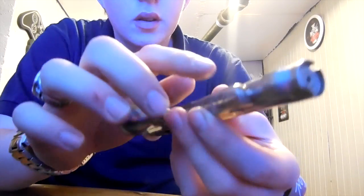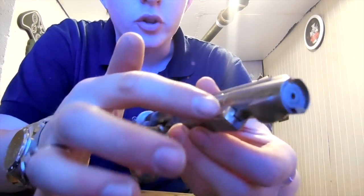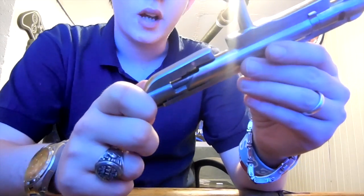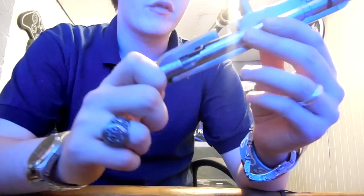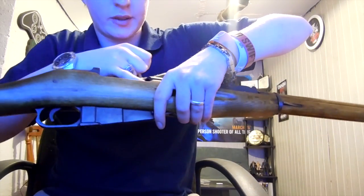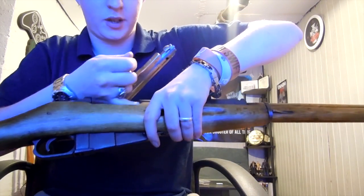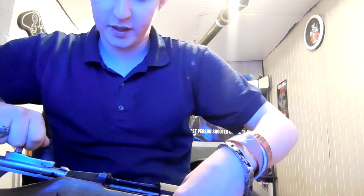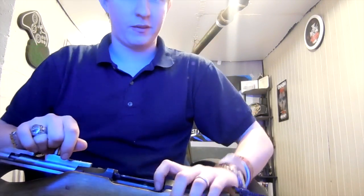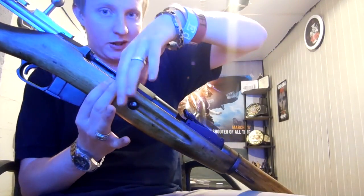Polished all of that, and then I just put a couple drops of lube here, here, as well as here, and then I worked with the slide, cocking it, decocking it, everything like that for about an hour one night, and just worked it, cleaned this area right in through here extremely well. Because when you first get these things, they're caked with cosmoline, and it's a little bit hard to clean this area right here out.